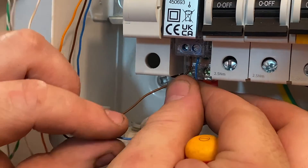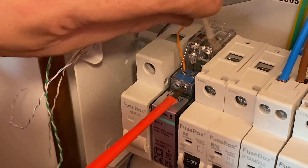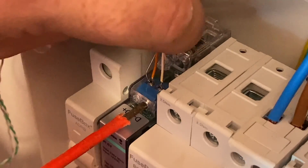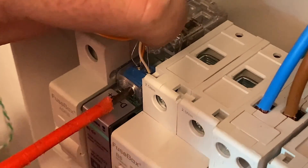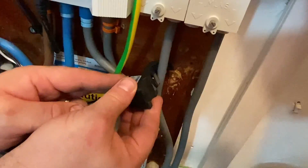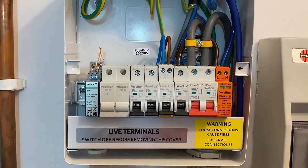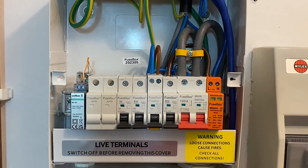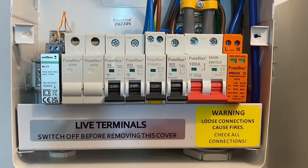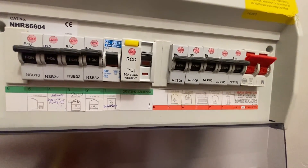The data connections are made at the bottom, with brown and blue being the 12-volt supply from the EV charger, and the orange-white and white-orange being the current drawn from the property via the CT clamp. Clamping the CT onto the main tails, making sure the arrow is pointing in the direction of current flowing into the property. Finishing off by terminating into the double-pole RCD - and as previously mentioned, we've installed a separate consumer unit on this installation as there were no spare ways in the existing board, and it makes everything look a lot neater.